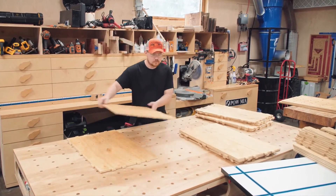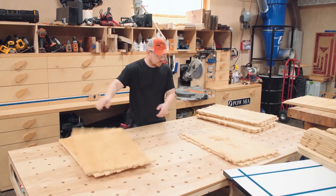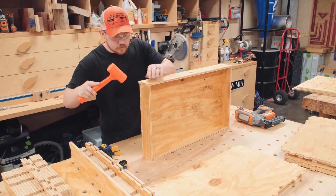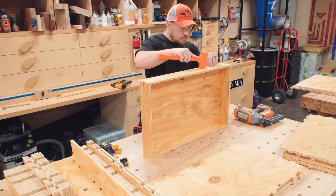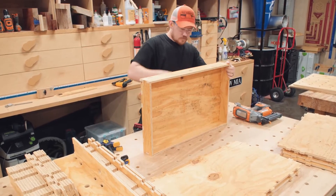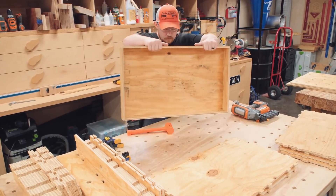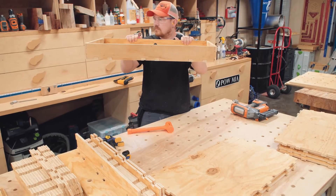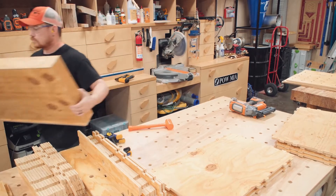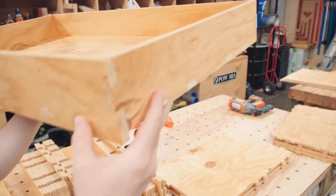The warp kind of remained in the smaller pieces — most were acceptable but a couple made me a little concerned. Before I did any design work on this build, I cut a few test slots in scrap plywood to determine the appropriate joinery dimension. It turned out that a slot width of 0.47 inches was perfect for this half-inch CD plywood, which means the standard mortise width and tenon length are all 0.47 inches for these pieces.